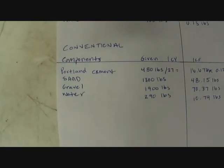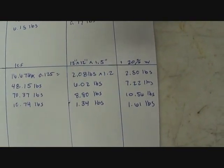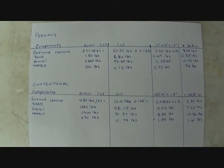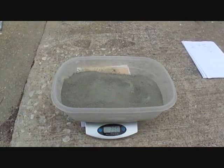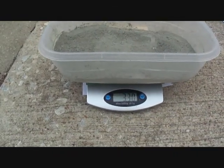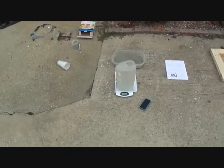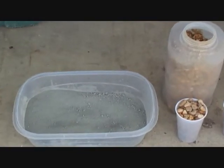I repeated this step for our conventional and did the exact same thing and came out with different results. We're going to continue with our calculations and move to the next phase of mixing the concrete. Taking the cement to find our first mix — the pervious — which is 3.30, and that includes the canister weight, so the cement weight is 3.06. We've accounted for the container weight on our water, which should be reading at 1.4. So here are our materials laid out for the pervious concrete, including the 20% waste.